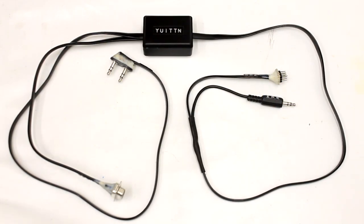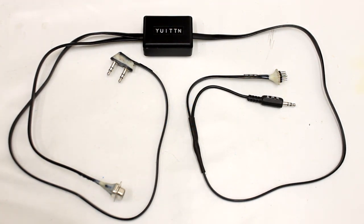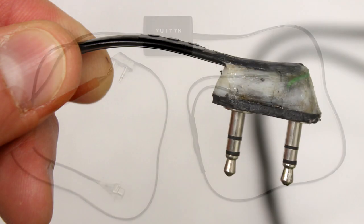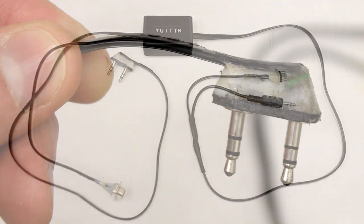Unfortunately, I didn't implement pin number 13, since its position doesn't fit the regular 2.54 millimeter raster. For the bidirectional audio connector, I used a piece of black plastic where holes for 3.5 millimeter connectors were drilled, and then everything was sealed with hot glue in order to make a single unit.